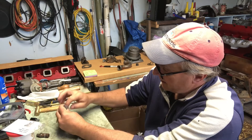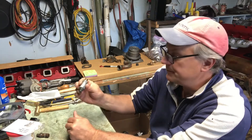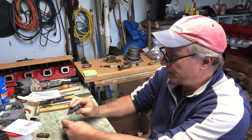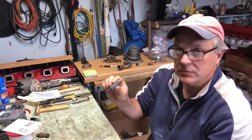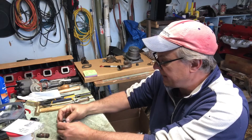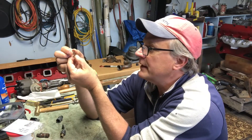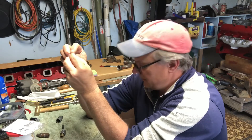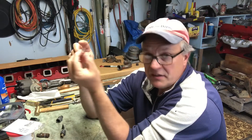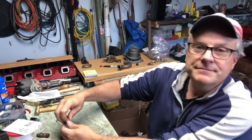In Alaska we have tons of silt out here in western Alaska, so it was just 50 years of buildup. Anyway, it's gonna go back together now. I place it together, screw it back together pretty tightly. What I read online is this is standard maintenance. If I blow through it, I can barely make it go through one way, but it blows easily the other way. I thought I might put just the smallest amount of tension on that spring, just to make sure that after 50 years of being compressed it hadn't lost too much — maybe a millimeter or two. All right, put it back together, calling that part done.